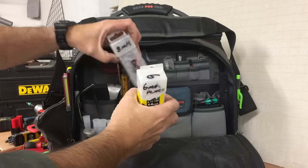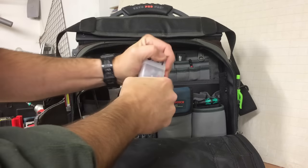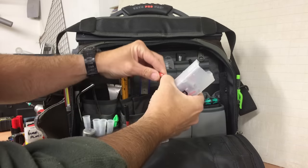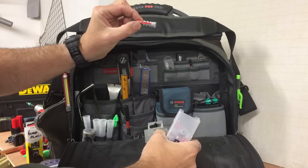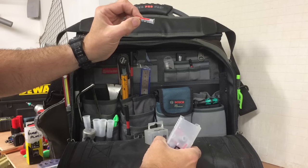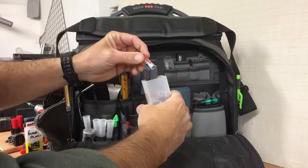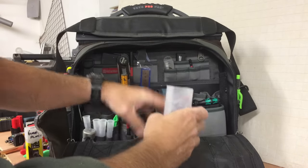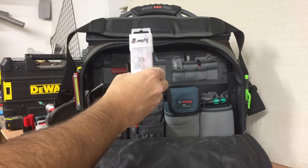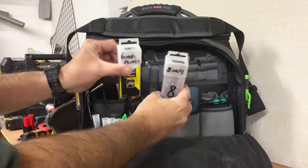I carry a little box full of 6mm and 8mm plugs. These are the plugs I favour — the Fischer dual power. You can use these for anything. They're particularly good for putting into plasterboard, screwing and opening them up — good for light to medium stuff. I've got a full box of different fixings in the van, so it's handy to have these little ones that deal with most things.